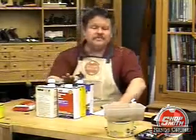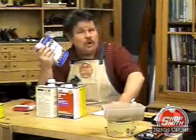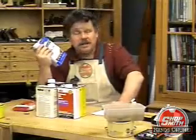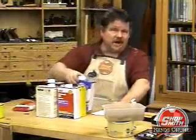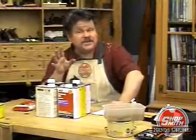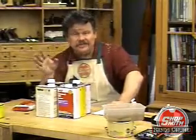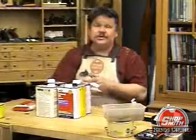Here, you have absolutely no choice but to put them on thin because they're watered down. It's mostly solvent or volatile liquid. It goes away, leaving a very thin coat of non-volatile resin solids. So that's why it's easy to apply and hard to mess up. There's less chance of runs, of pooling, of uneven coverage. It just goes on and stays on.